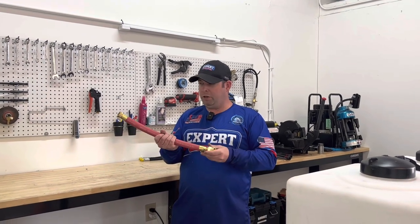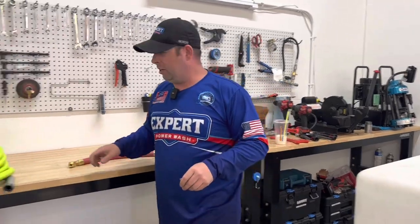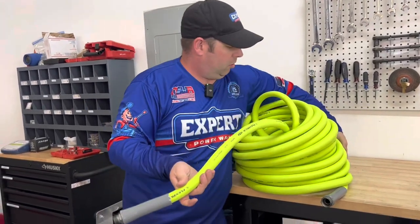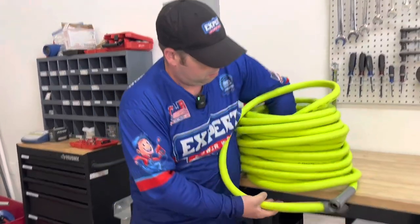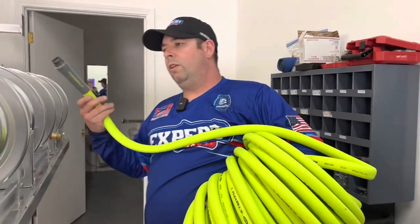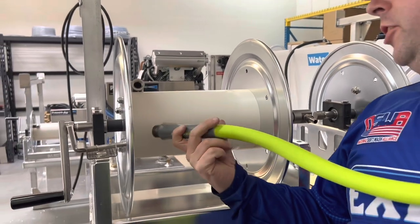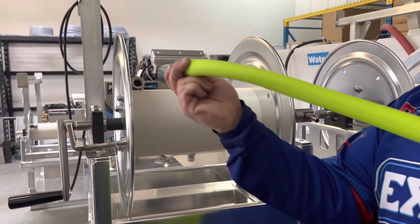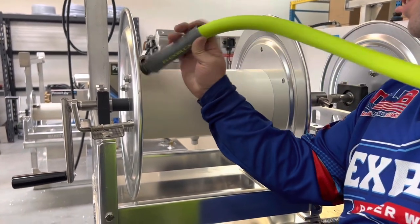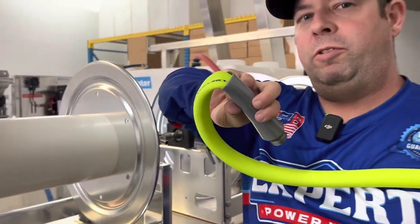What we're doing with these is using them to make the garden hose fit better on the hose reel. This is a great garden hose by the way — three-quarter Flexzilla. What we were doing before: this is half inch, so we would use a male half inch to a female garden and just put it in there. What happens is when you roll this, it cocks right here. Unless you pull out all your hose, you've got a bend that's restricting your water flow.